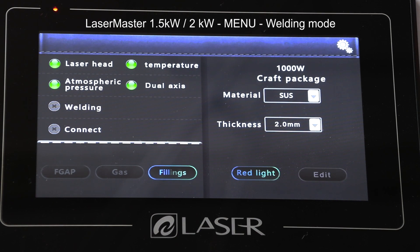You can see it's on. Next is my gas — this switch opens the solenoid valve for the air supply. Please note it very well: I need my air to be very clean, without dirt or any moisture. It's very advisable to put air dryers on your airline.